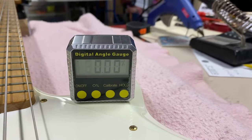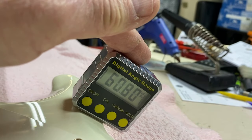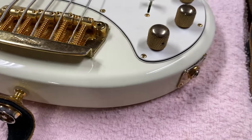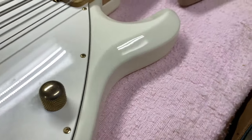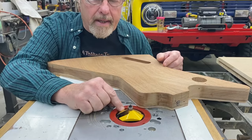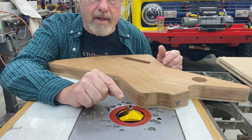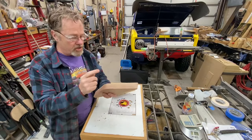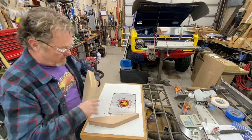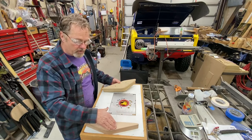I've got this Music Man bass and we'll see what kind of degree bevel it has on it — I'd say 60 degrees. So this is a 60-degree bevel on this Music Man bass, and as you can see it starts out narrow and gets wider as it comes around the guitar, then it comes back off near the neck. Here I've got a 60-degree bit in the router table; this one I only paid $25 for. I've made a test piece just like the guitar body — mahogany, a little stripe of walnut, and a maple top — and I made a template to go over it to try this 60-degree beveler, doing something similar to what's on an SG guitar.